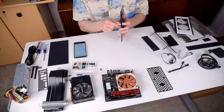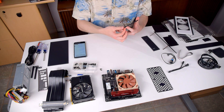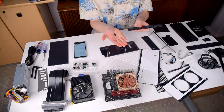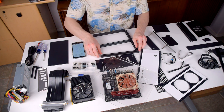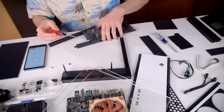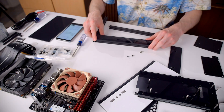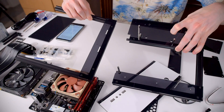It starts with installing standoffs on the two left side interior panels. The instructions on their website are pretty well annotated so putting everything in the right mounting hole is fairly straightforward. Next step is to screw the threaded spacer into the 250mm aluminum bar. The acrylic panels are held to the aluminum bars with nuts that fit into the channels in the extrusions. The aluminum is what forms the frame, but the acrylic is what holds it all together. The right side assembly is the same — lay out the aluminum bars and mount the acrylic panel to them to hold them in place.